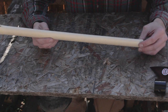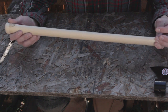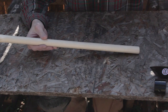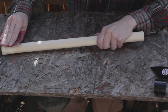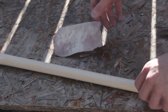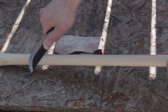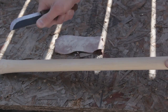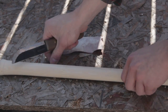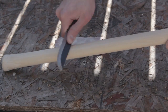There is a clear finish on the tomahawk handle, and I want to restain it, make it a little bit darker. So I'm going to sand off whatever coating they have on here. That coating is pretty thick — you can see it just sort of gums up the sandpaper. One trick I saw on YouTube is guys were using the back of their knife to scrape it off. You can see the little shavings — that's not the wood, that's the coating.